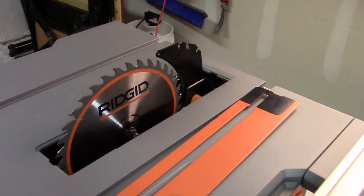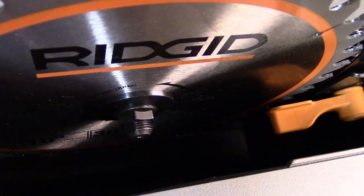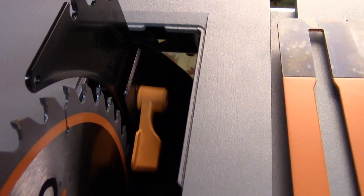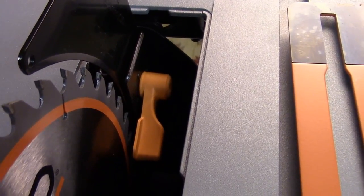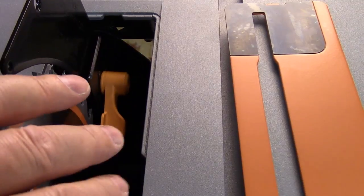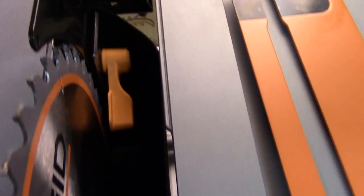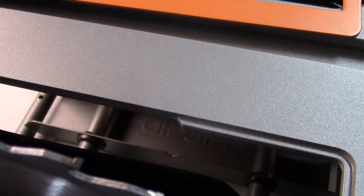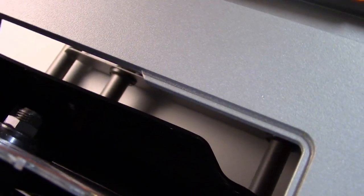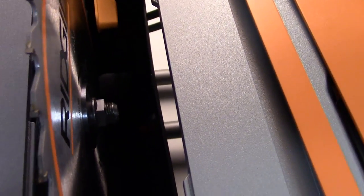Let's take a peek under the hood from the top of the saw. There's enough threading so that you can apply a dado stack to that arbor. Back here is the riving knife, and like several other saws, it has a very high visibility lever to adjust or remove your riving knife — very convenient. There's enough gap between the blade and the side that you can get your hands down there fairly easily. One thing I noticed: the dust control ends about three inches before the tabletop, which makes me wonder how good the dust control is with that gap between the tabletop and the dust control cowling.